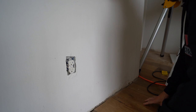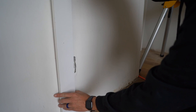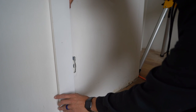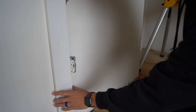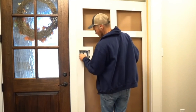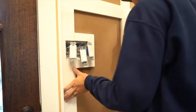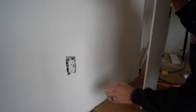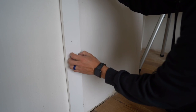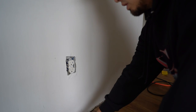After I find my panel dimensions, I have a vertical style that's going to basically split this electrical outlet right in half. One option is to leave it in this location and build out a box around it — I've done that especially when there's a gang box with a bunch of wires I don't want to move and there's not enough slack in the line. Another option, if the outlet landed right in the middle, is to cut a hole and pull the outlet through, but that's very rare. So typically what I'll do is just move the box.